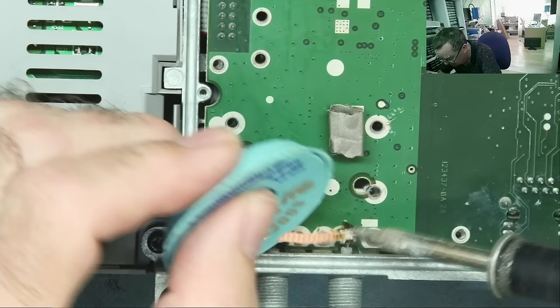And yeah, it is effectively booting up. That's a little bit surprising. Just nothing wrong with my multimeter, is there? Let's just get back onto volts again. Well, you know, guys, you can always try another multimeter. Okay, volts range. I'll take a ground from like one of these things, actually, where it bolts to the chassis. That must be ground. What have we got? The same thing, yeah. So it looks to me like it's power supply. It's got some sort of problem.